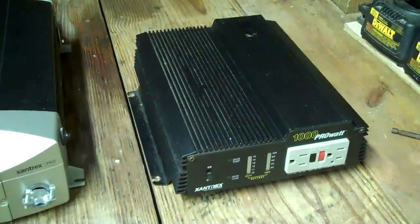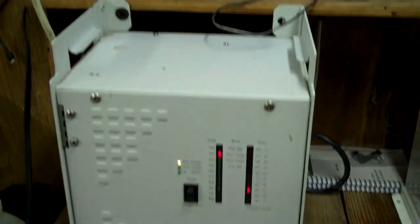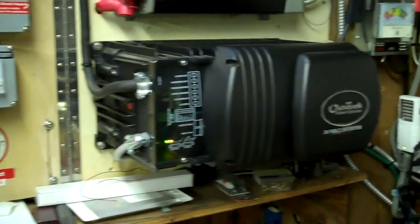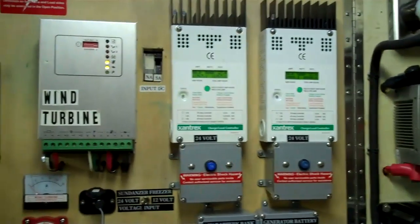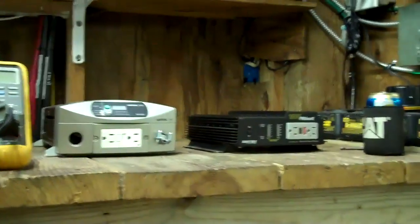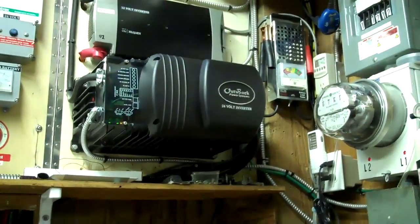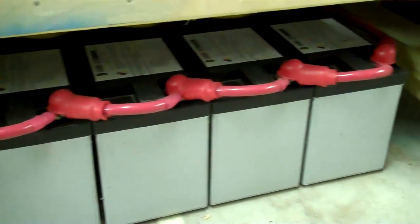I hope that answered some questions on inverters and cleared up some of the misconceptions on just how much amperage AC stuff will draw off of DC. The best way to do it is to try to keep everything in watts. I'm going to try to do a battery video next where I'll go into batteries and convert amp hours into watts — it's very simple. You just take the amp hours of the battery and multiply by the voltage, so times 12.6. Most people want to get 12 volt inverters because they're cheaper, and there's a big misconception that higher voltage inverters are more efficient — it's simply not true.